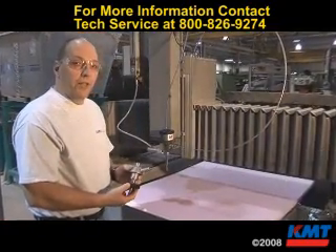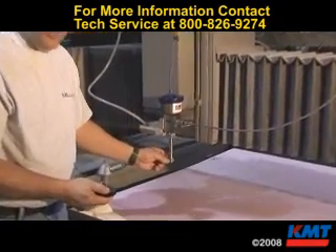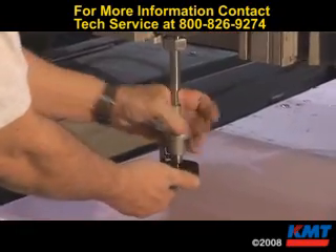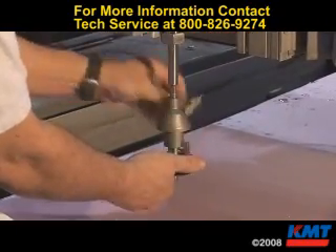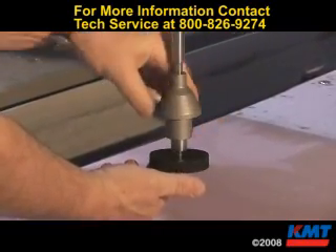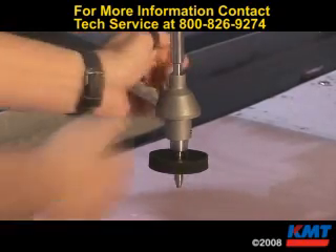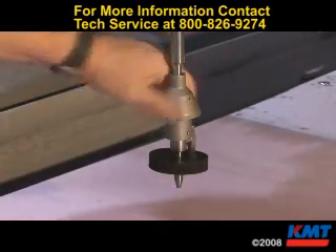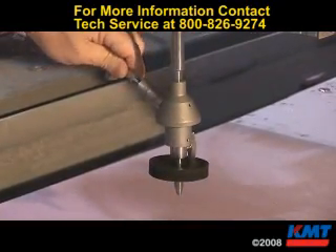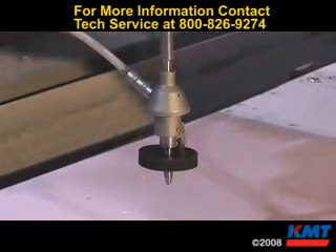This is the installation of the AutoLine tube cutting nozzle. Apply a small amount of goop to the threads of the nozzle tube, slide it up on, and thread it on left-handed. Thread it on until it bottoms out and use the handle as leverage to give it a good tug — make sure it's tight. Insert your abrasive hose over the feed tube and you're ready to go.